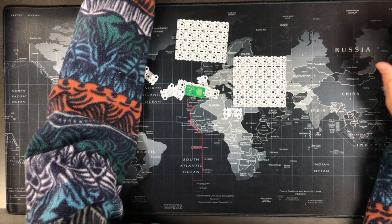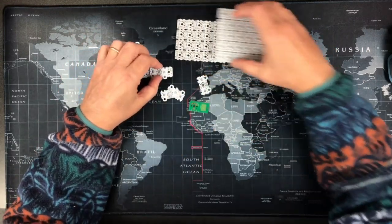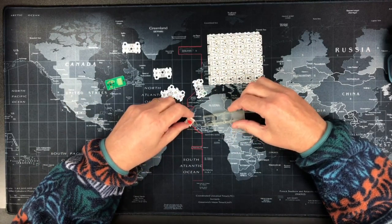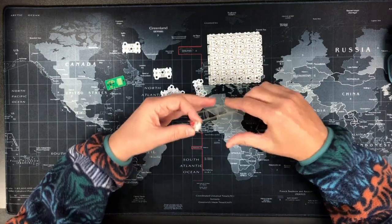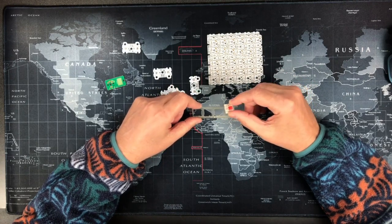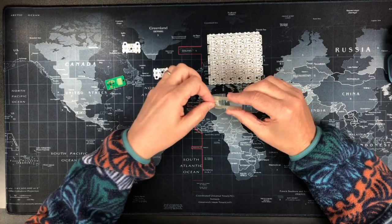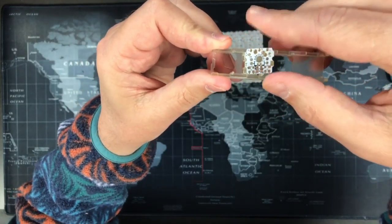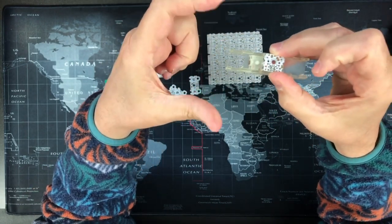And one of the things I thought is the hand wires look messy, but the Amoeba single switch PCBs seem to make it cleaner from what I saw. So I ordered these, and basically I was just looking at them, but it's kind of complicated. But the deck keyboard is interesting because the keycaps are longer than they are wide by a fair bit, and these plastic assemblies are what have that gap between them. Well, anyways, this is a PCB equivalent. I mean, this is a Cherry MX equivalent of what that plastics assembly would look like, so I can pop my switches in like that. But I was wanting to see if the Amoeba would fit, and of course it doesn't. It's too wide to fit in there. So what I'll end up doing is probably trying to widen these parts enough to get an Amoeba in there snugly.